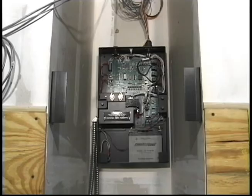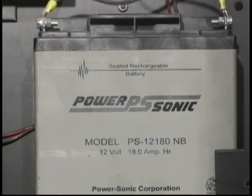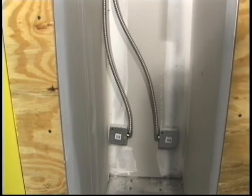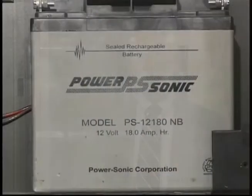The automatic closing system consists of a DC motor, a microprocessor and logic board to control inputs and outputs, DC batteries, and a battery charger. All of these components must be located within a fire-protected enclosure. Access to this enclosure will need to be provided for final hookup and periodic testing and service. The in-house 120-volt AC system continually float-charges the batteries at 13.5 volts. If loss of AC power occurs, a fault signal is immediately sounded.